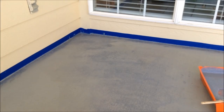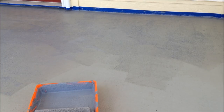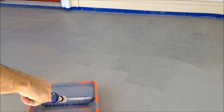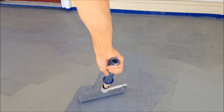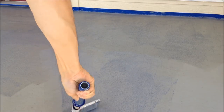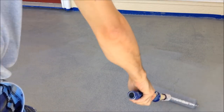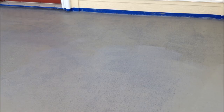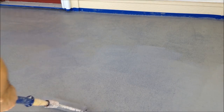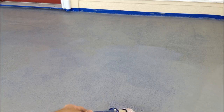I'll show you more when we're done. This is a base coat, so I just get it down. I'm not too worried about coverage as much as making an adhesive layer. I'm probably going to wind up doing three thin coats. One thing to watch out for is splattering — if you've got quite a bit and you're going fast, it'll throw it up on your siding and stick. So just be cognizant of that.